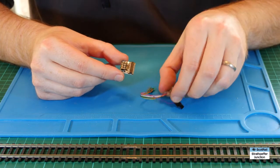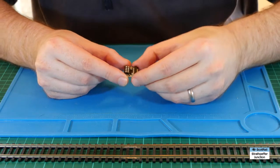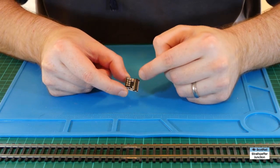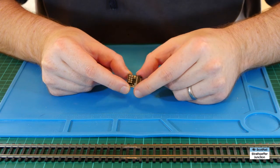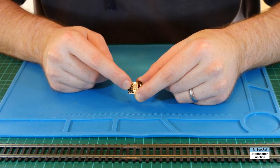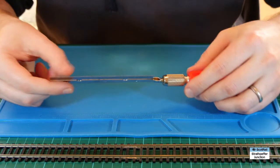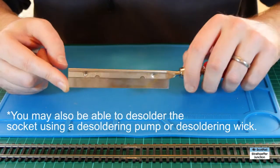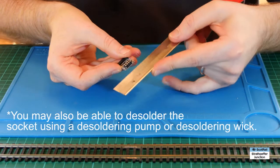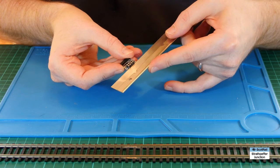What I did to make the 8 pin work with the adapter - I'll pop this aside for a second - is to cut off the 8 pin socket so that what we're left with is the 21 pin socket and a PCB with solder tabs that we can access, which is the key thing. The way I did this was to get a modelling saw - I think this is an Expo brand, but there's a variety around - and very carefully cut in between the PCB and the socket in a very careful back-and-forwards motion.